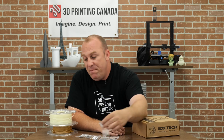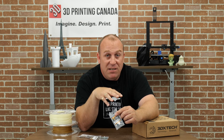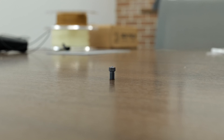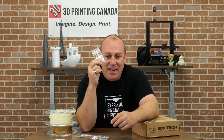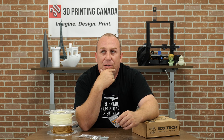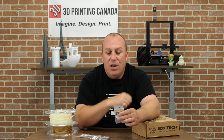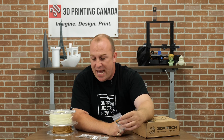You can use clone hardened steel 0.6 nozzles with good results, but if you really want to step it up, I personally use the Slice Engineering vanadium nozzles or the Micro Swiss M2 hardened steel nozzles for abrasive materials — works great. Temps go up about five to ten degrees on more polymer-based products. I've even printed TPU through the vanadium nozzle — absolutely wonderful. The printer downstairs, a Formbot Troodon, has been running on the same 0.6 Slice Engineering vanadium nozzle for about a year — carbon, glass fibers, everything goes through that machine and it's never let me down. This is an E3D-style nozzle, so all your E3D-style hotends will fit this.